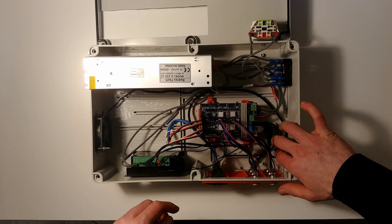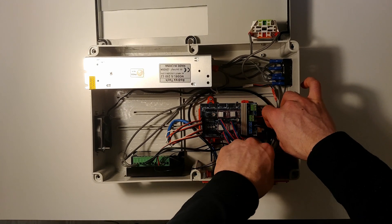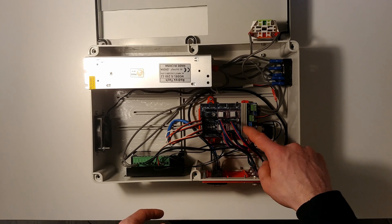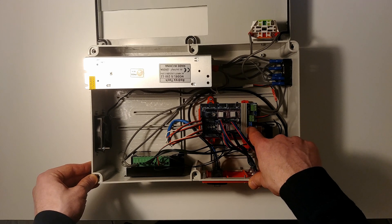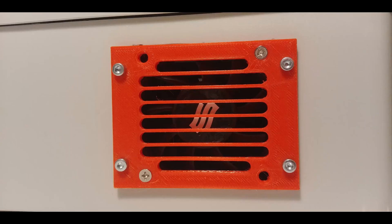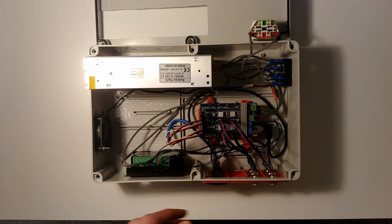Back to the inside of the box: as mentioned, there is a five-volt pass-through for the servo power and limit switches, done through a 12-volt to 5-volt DC converter, and that's been wired from the RAMPS board's D9 slot so it can actually be turned on and off from the Arduino code. Right next to this DC converter, on the D8 port, there is a 12-volt fan connected — I believe it's a 60mm fan, just a regular PC case fan I had laying around — wired to D8 so you can have some airflow moving through and cooling the stepper drivers.